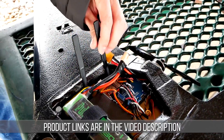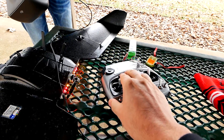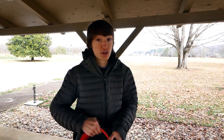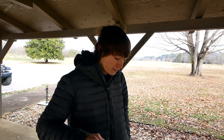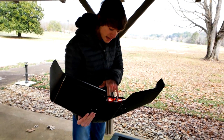We've got our antennas and GPS and compass. The latency doesn't look painfully bad on the ground, but in the air it's noticeable — especially for someone who flies FPV planes and quads regularly. It's noticeable enough to be a little terrifying; it makes you scared of being anywhere near the ground, since you may be closer than you expect. We're running iNav on this because iNav has much better servo support than Betaflight — Betaflight can be made to work with servos but it's a pain, whereas iNav is relatively easy.